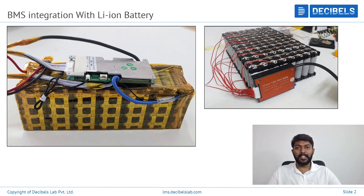Basically, in series, voltage adds up and in parallel, current adds up. So there are two parameters: one is the voltage, and one is the discharge current — the maximum current a BMS can handle. We look at the overall voltage and the discharge current.